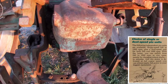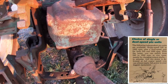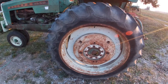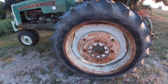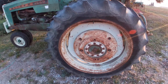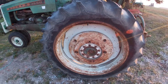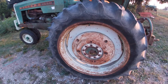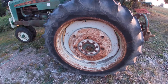The 1550 uses the dry PTO clutch, much like the 1600 — so nothing really changed there. These tractors also for the most part had 15.5-38s on them, which was a relatively new tire size at the time. It's a size that's remained popular even today, so you can still find 15.5-38s in a whole variety of brands.